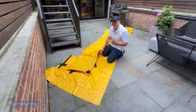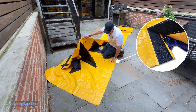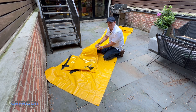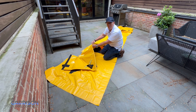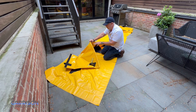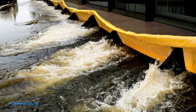Here we have sections connected — a corner section and a straight run, both 20 inches. As you can see, we've already velcroed the bottom section together and this creates a watertight seal between the two sections. We've also velcroed the top section, and there's something a little different — we've got velcro at the top but also at the bottom. The reason we do this is because as the water rises, the upper portion of the clamshell is subjected to higher hydrostatic pressures and we want to make sure the sections don't blow apart under that pressure.